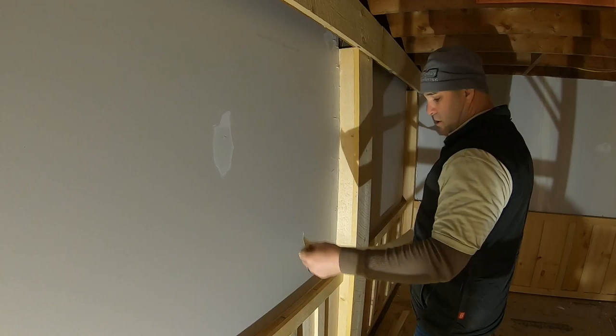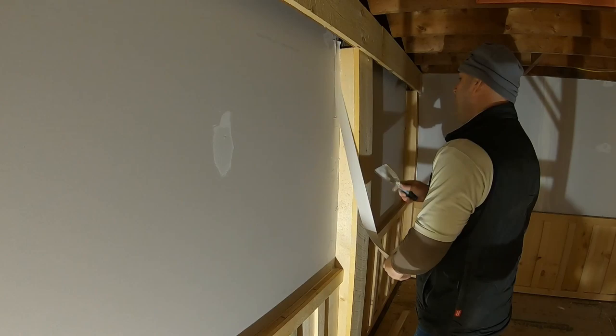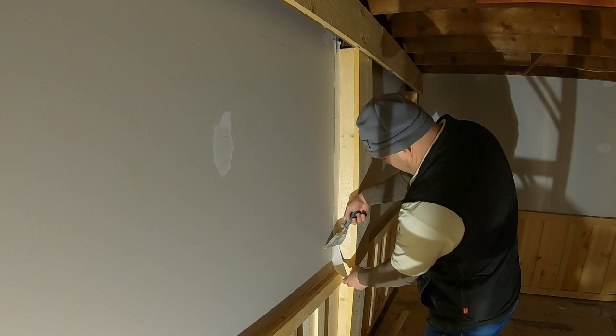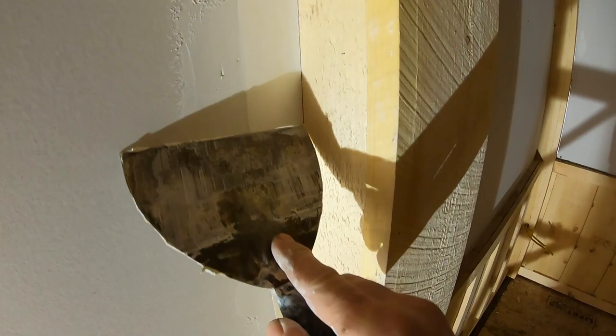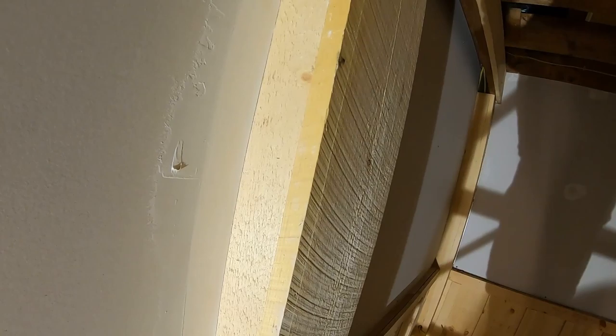Once you've got a nice healthy coat on there — a little bit wider than the tape — run your tape. I'm not a professional but they do it like this: run the tape right tight to your beam, get her right in. Run your knife right down, hold a little pressure and pull. The tape needs a nice square edge. See how it's nice and tight? Then you're just going to run this nice and gently — you don't want to push too hard because you'll wrinkle the tape on the first pass.